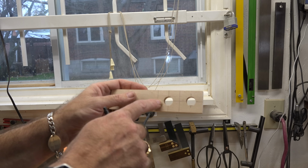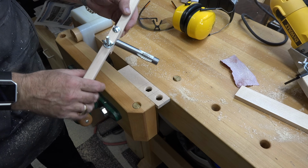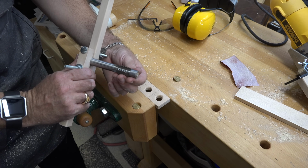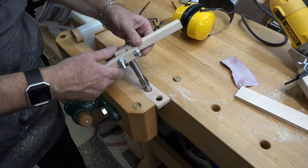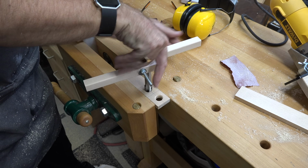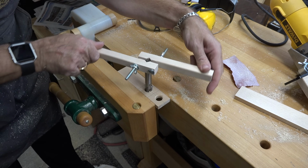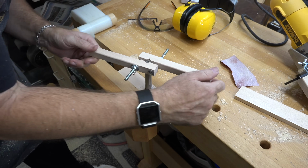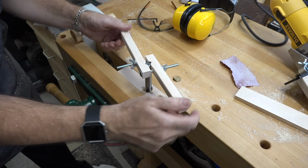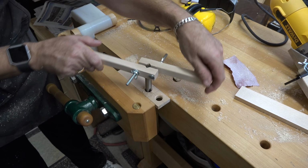We need to take a large countersink bit and we're going to countersink both sides of both of these holes. We have our 3/4 tap installed in our shop-made tap handles, and these have a kind of a guide bushing on the end here. So we've got the countersink done on both sides, and it's as simple as just gently turning this into the wood. It's very sharp and you should have no problems cutting it. That guide bushing that's on the end is going to help guide it in so that those threads are cut square and true. Of course, the thicker the material of the nut, the better job that the bushing is going to be able to do.